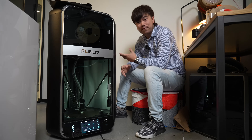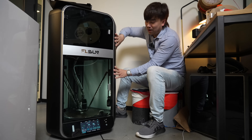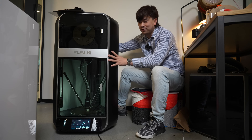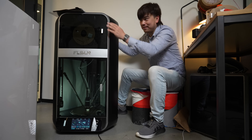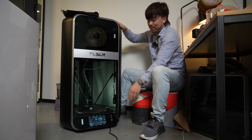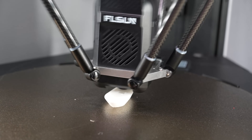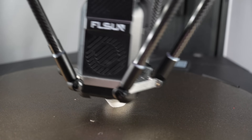How did they make this printer so fast? It all comes down to the construction and component selection. These large broad panels on the sides — you can see if I tip it at an angle — are about a five or six inch wide beam with good thickness. Inside the frame is a solid piece of extruded aluminum, with die-cast top and bottom pieces. This thing is super solid; it's essentially like an eggshell of high-strength aluminum containing everything and making sure there are no unwanted vibrations, so it can move extremely fast without shaking around too much.